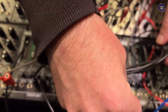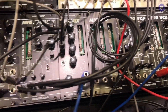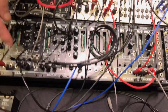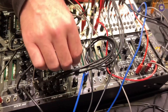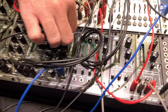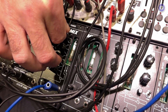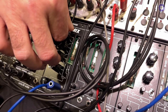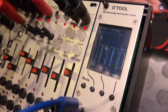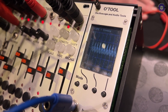We have a mixer, which I'm going to plug into. What you are hearing is the output of this second oscillator. The mixer is designed so that it mixes the signals together and then overdrives the tube. You can see it pushing up into like a square wave and then back down into more what the original wave going into it was.